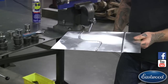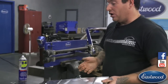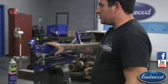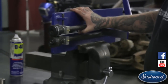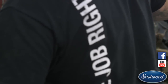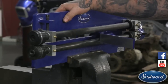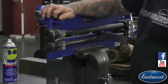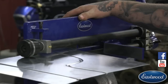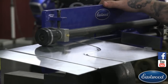So that's starting from end to end — all you need to do is drop it down, make it finger tight until it touches, and roll. That'll do a full draw, the full depth that you can do. If you're doing a thicker gauge metal, this machine comfortably can do 18 gauge, but there are times when you're doing a larger or deeper bead where you may have to do it in multiple passes to make it easier on the guy cranking. We did a whole entire seven-foot truck bed sides with this little bead roller right here.